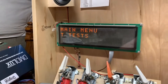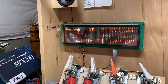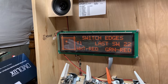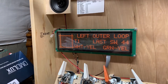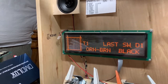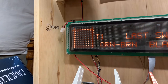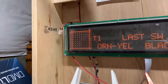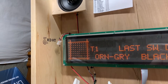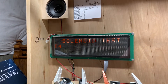So let's put it into test and test the switch edges, and I'll go across the diagonal. We'll see each switch row and column working, and here are the coin door switches. And of course the back switch does that. So all the switches are working correctly.